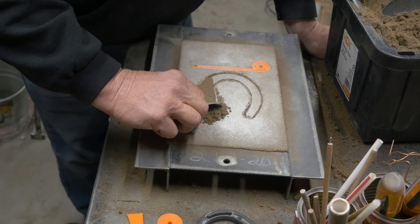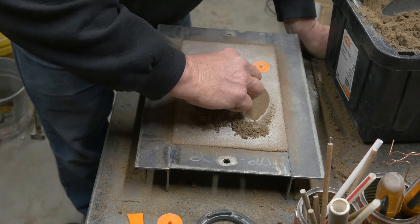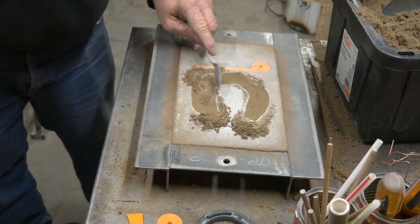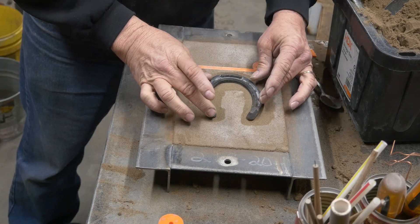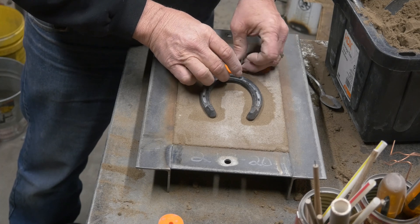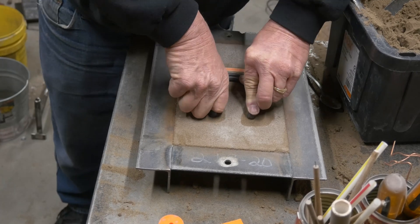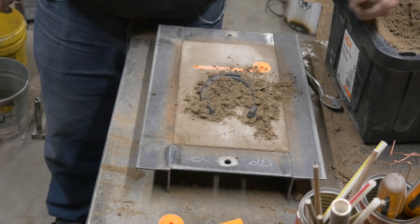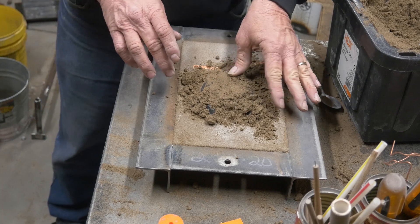Now I'm just going to go ahead and start digging this out. I'm only taking out enough material so I can get down to that natural parting line on the part — not a lot of material. I'm going to do it wide enough to have some material outside of the thing; I don't want it to be just a real thin fill. Now I'm going to backfill into the horseshoe, making sure it's in the right spot for where the gate's going to end up, and fill in around it to pack in to that natural parting line.